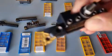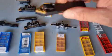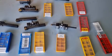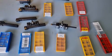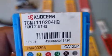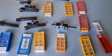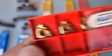This one here is WNMG — so it's a W — whereas the triangle is T for triangle. Where you see the W, that'll be for trigon. There are codes and charts out there — the list goes on. Something like this will be TCMT — just your typical triangular type. Trying to remember them all is harder than you'd think, and when you look at something like this you've got totally different codes for these as well.